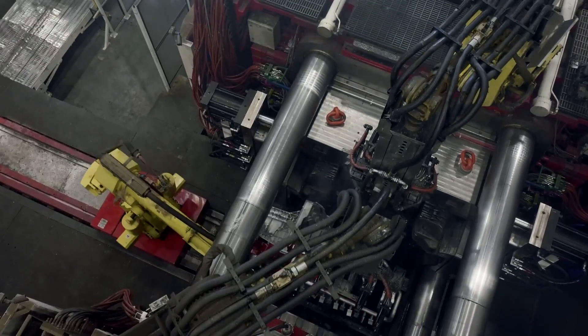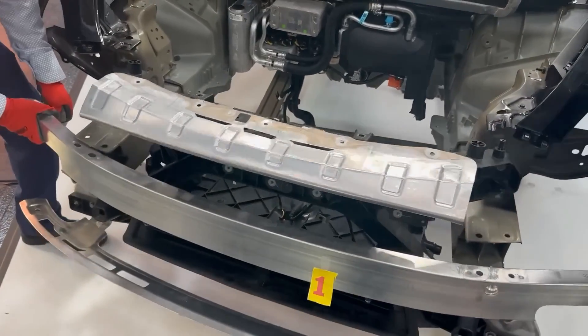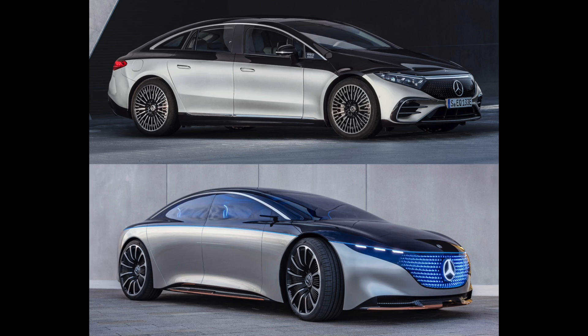It's difficult to convey just how many advantages Tesla now has — from this modular assembly demonstration, ongoing cost savings of deleting parts and processes, re-engineering components to be single parts instead of multiple, the best example being gigacasting, which has eliminated hundreds of individual parts into a single-piece casting that allows components to connect or drop straight into position. Legacy automakers are hesitant to use gigacastings because they have traditional stamping presses, all bought and paid for. The advantages are beyond obvious, but it requires expensive investments and factory disruption. Innovation is expensive, but so too is complacency.